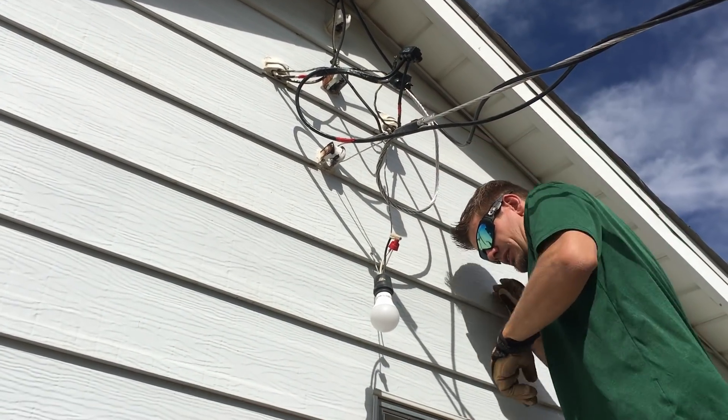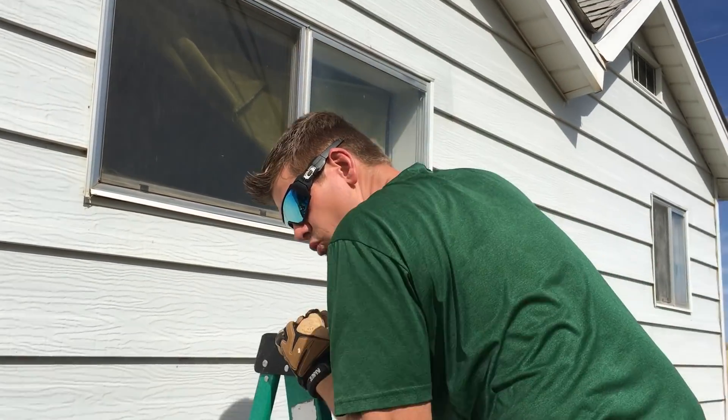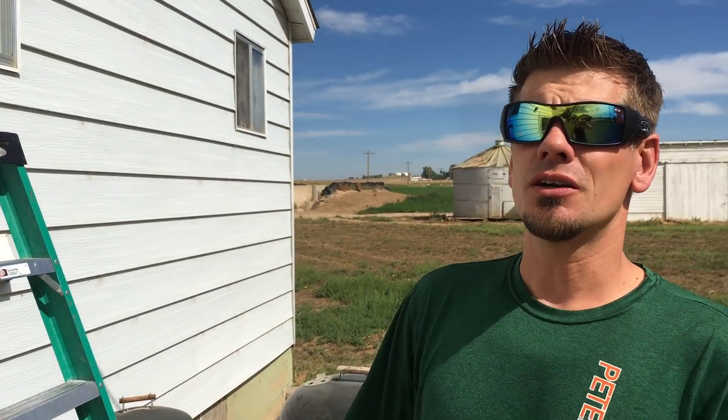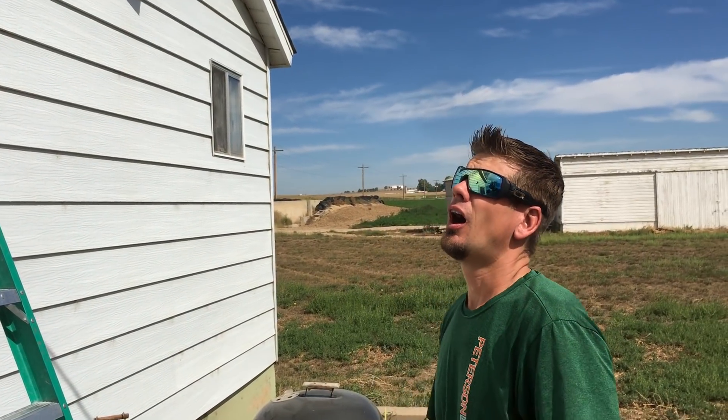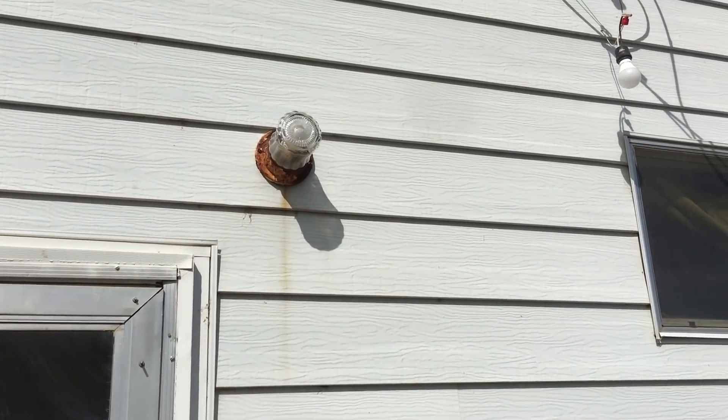This house — I went downstairs in the basement — has knob-and-tube. This house was built in probably 1895 or 1900; it's 110 years old minimum. We've got a light fixture there — who knows if that could have energized it — because there are no grounds in the house. NEC Article 250.130 talks about our EGC grounding and our branch circuitry, as well as Article 406 and your plugs.